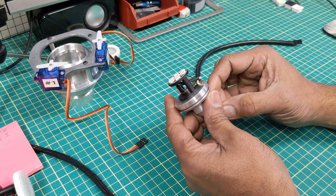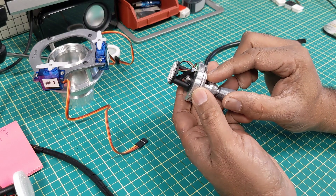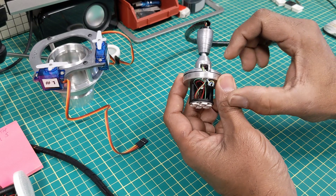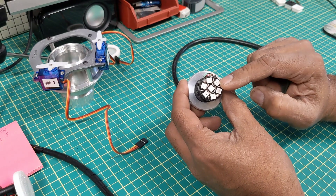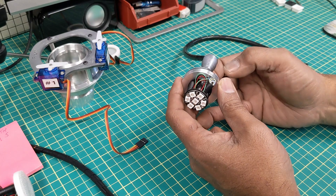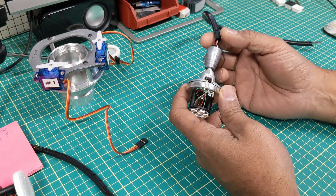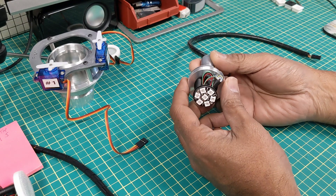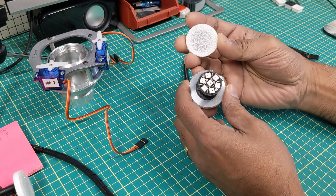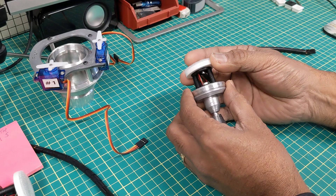I have made a mount for my NeoPixel ring, so this gets all screwed on. You can see inside there is an M4 bolt and it goes all the way through into the nut inside. That holds this whole sandwich together. And this is a NeoPixel 7-segment one that FilthySketch asked for. I just coiled up all the extra wires because this slip ring comes with six wires and we only need three — I coiled them up in case one breaks. I have extras in there. And then to diffuse this I made a cap with some foam backing that I put on top of the 3D printed housing, and it gets glued onto the outer ring there.